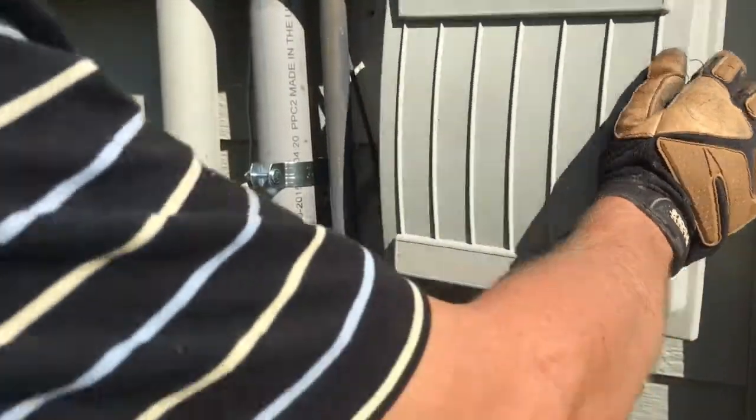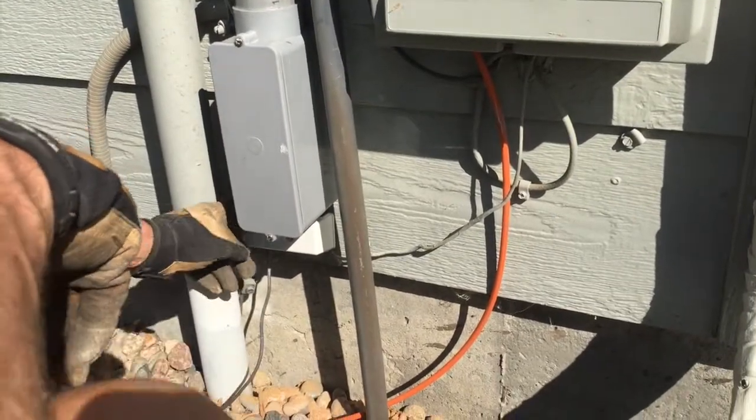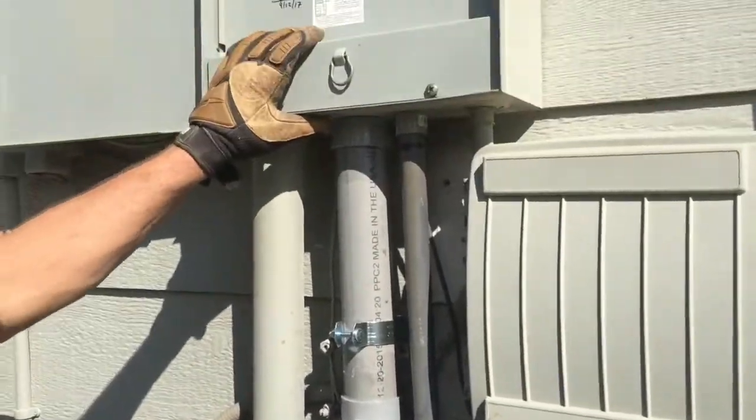And then this will just coil up inside of here, and that'll shut. That basically gives your ground to here, your ground to your ground rod, and that number six back up to your panel. Thanks, guys.